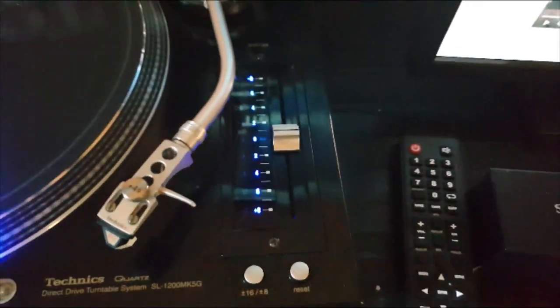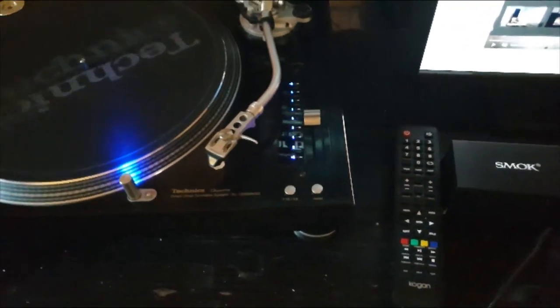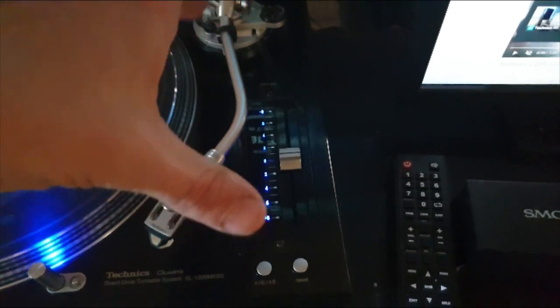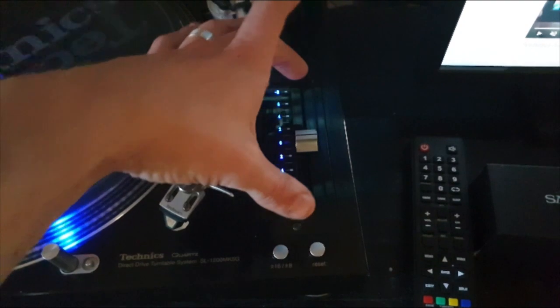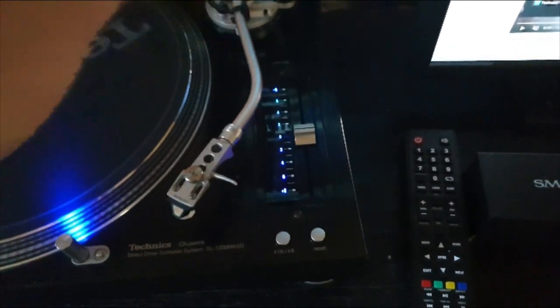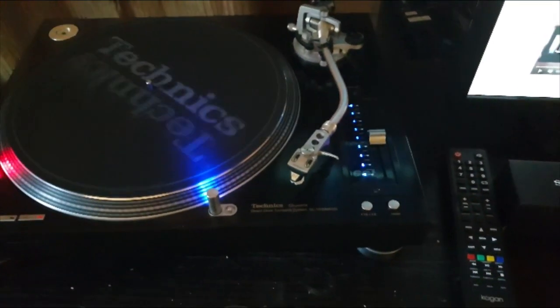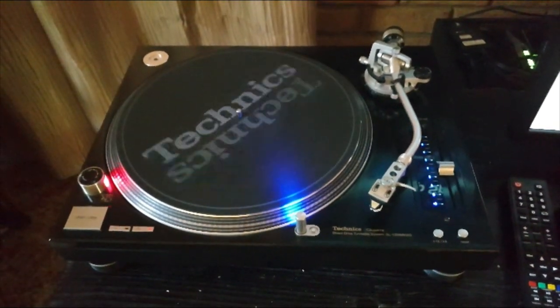Fortunately, just to do the modification of the pot wheel and reset it, you don't have to rip the turntable to bits. There are two screws there — take the plate off, take that little thing off. There are two more screws that'll drop the fader inside, and two screws in there as well — four screws in total. You can drop the fader in there, position it, move it out. On the top left-hand corner there's a tiny little pot wheel. I found I had to max that out just to compensate for the drop in resistance because there is no TP-17 anymore.